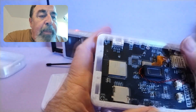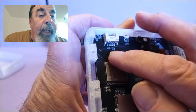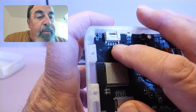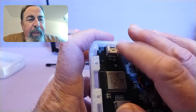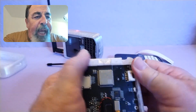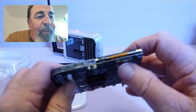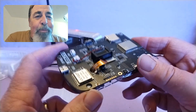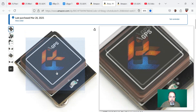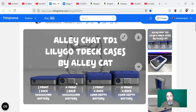Let's talk about the GPS. I don't have the GPS unit in yet, but you have to solder TX to RX and RX to TX — cross your wires — then there's VCC and ground. I'm going to tin some leads and just touch them onto the pads. There are videos of people removing this; I don't like to do anything that destructive. That's how to add the GPS to the case. I snapped it in one time with the memory card in and almost busted the memory card holder — good thing I have spares. This is a really small GPS module, 12 by 12 millimeters, and it's going to fit in a little square right on top of the T-Deck in the T-Deck case.